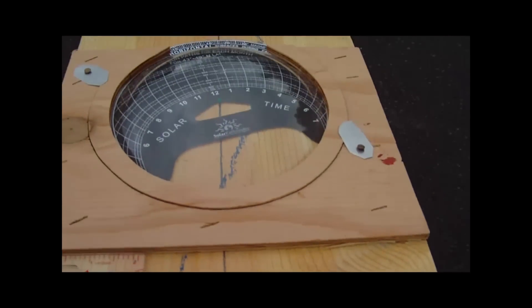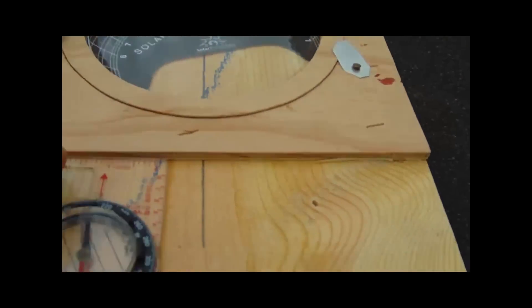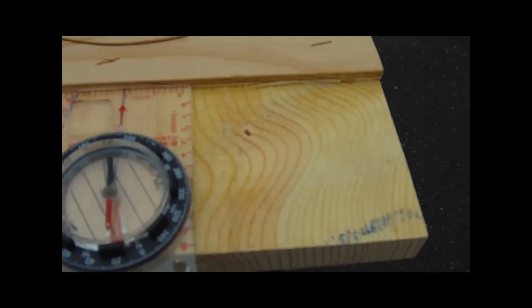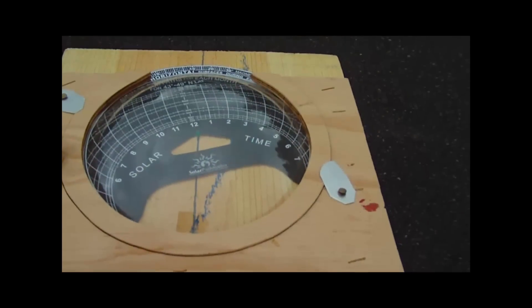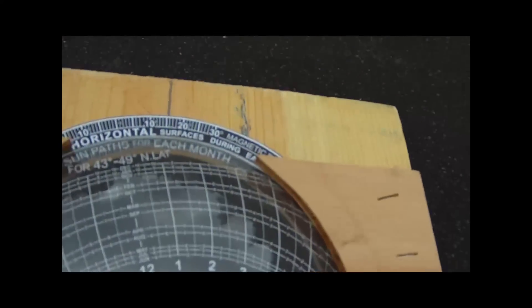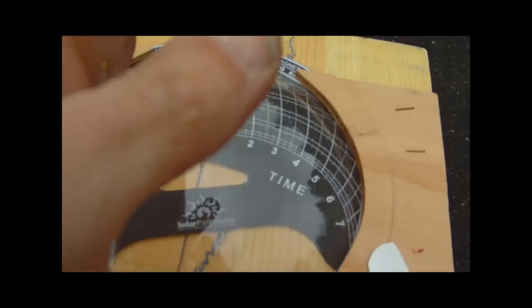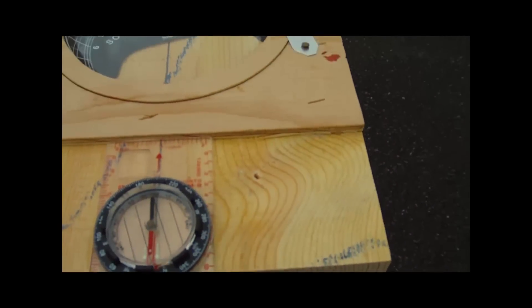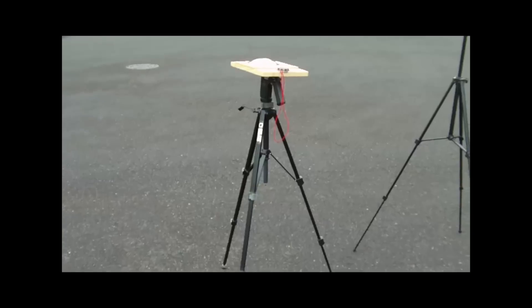Here's the center line that I've been talking about. You can see it running through and on all the way. I have a compass here that I'm going to put on that line, and I've lined up the needle so that it's on the line. Up here, you can see that I've set it for 16 degrees east declination, so that true south actually is more off in this direction.